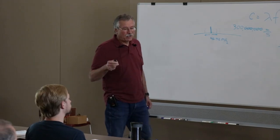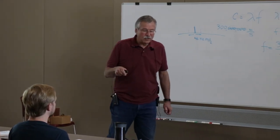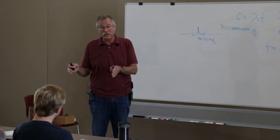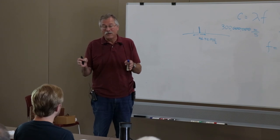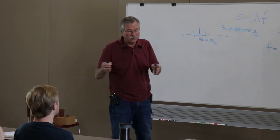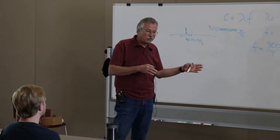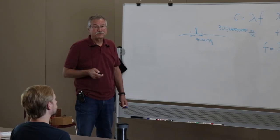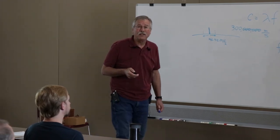You should know that depending on where in the country you are, repeaters are sometimes spaced at 15 kilohertz increments and sometimes at 20 kilohertz increments. Pretty much the Pacific Northwest is 20 kilohertz, everything east is 15 kilohertz, and in between it's either way. What is ours there? 15? 15.